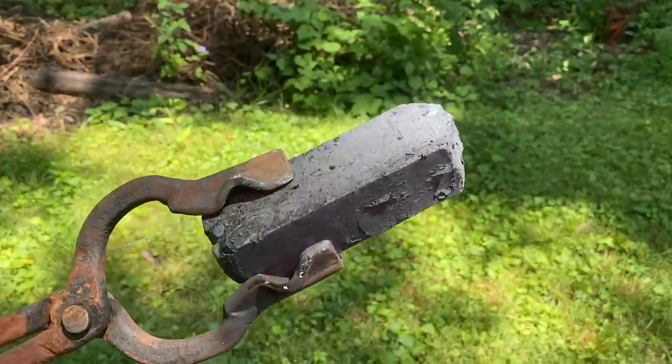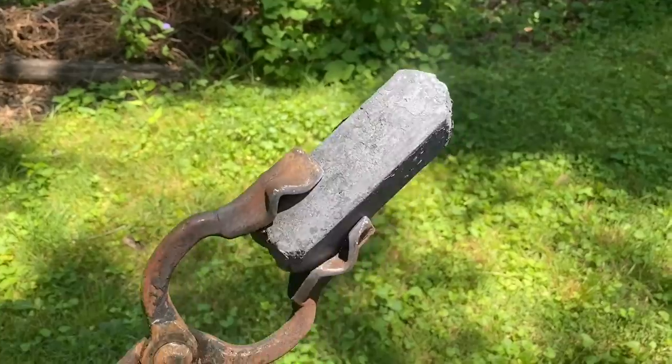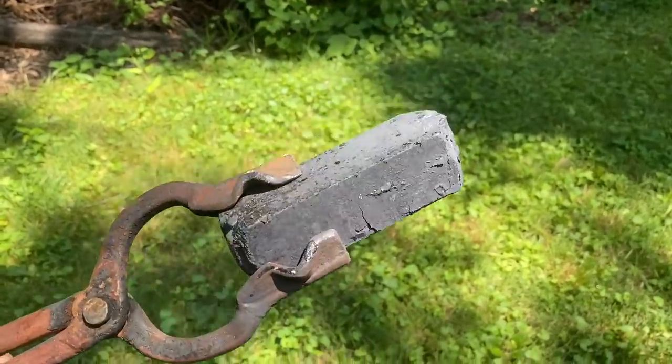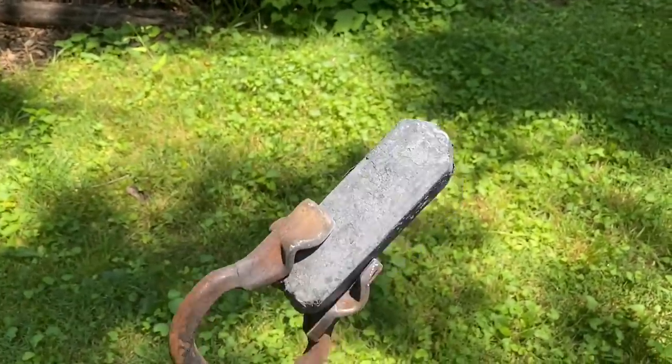Here's what we got after the cut and fold. I spared you the pain of watching me draw it out and use a KISS block, but I've got this thing to approximately 1.5-inch square. I need about 3.5 inches for the size of hammer I want to make. So we'll trim off the horrible ends and get a nice piece to work with and go from there.